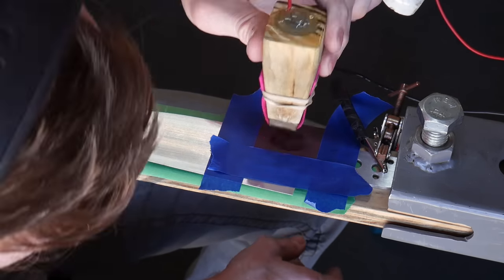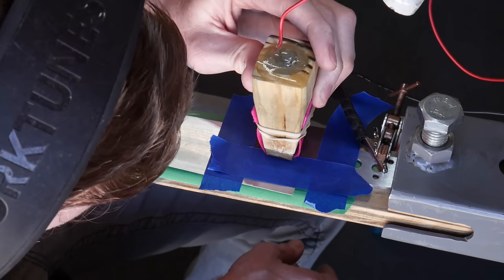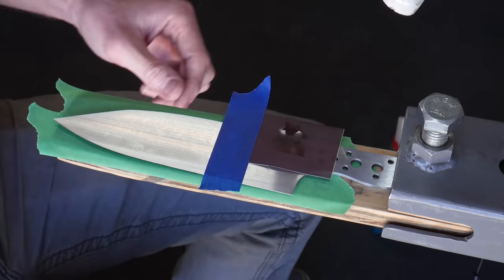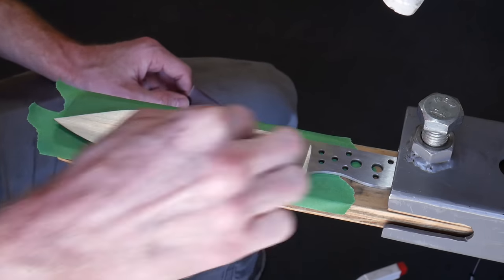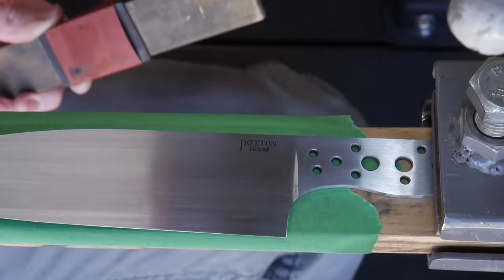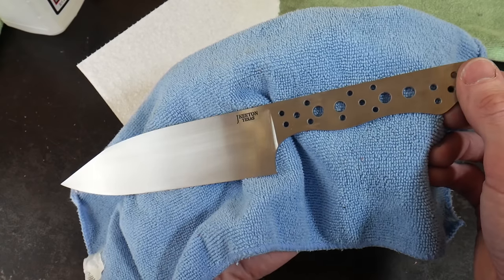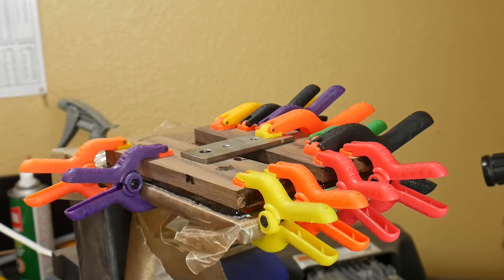In the meantime we're going to etch our maker's mark into the blade using my DIY etcher set on DC power. I'll hit it about 12 times with DC and three or four times with AC to darken it up. Once the mark is nicely etched, I take some 1000 grit sandpaper and make fine strokes along the length of the blade to clean up any residue and make the maker's mark pop. Hand sanded finishes make the contrast of the maker's mark look extremely classy.